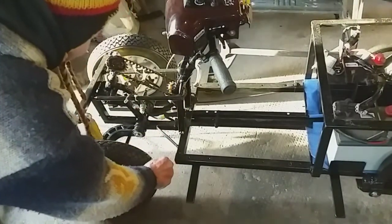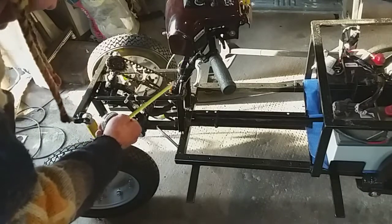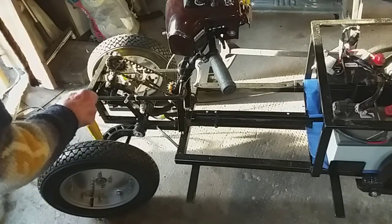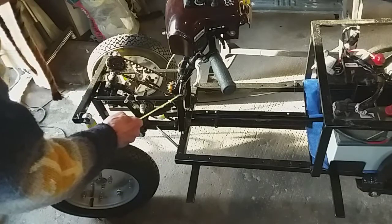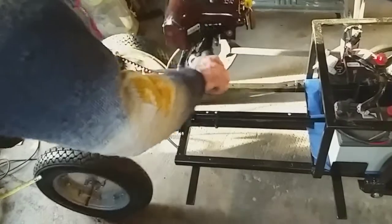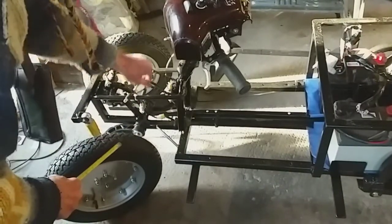I've put some box section on there, 25mm, and lined up the chain. I've had to make a couple of these. I think if you look on the other videos I've done, you'll see roughly how I've done that. I've put these nuts on here so that when you're welding up your steering, you're not going to get loads of play. Then obviously you can tighten and slacken these nuts to just take the right amount of strain on the chain, so you've not got any loose steering.